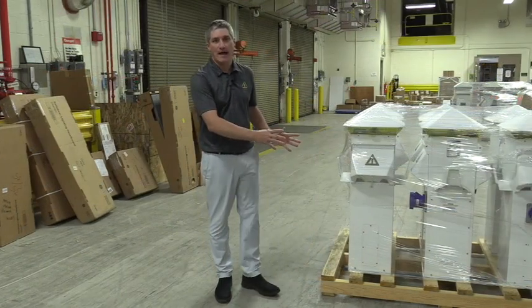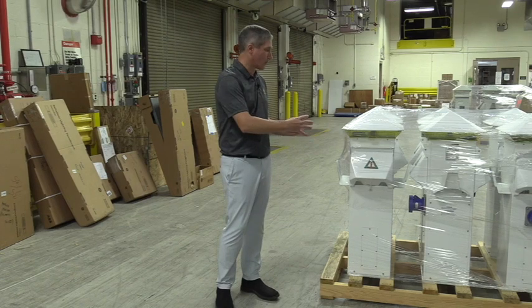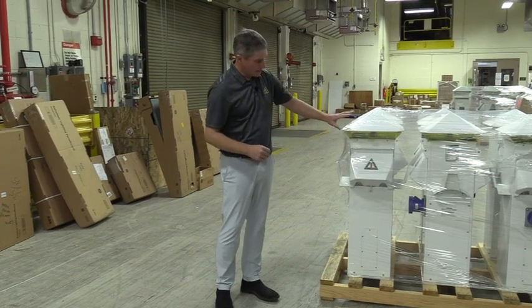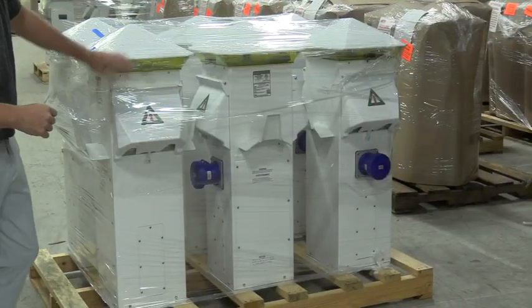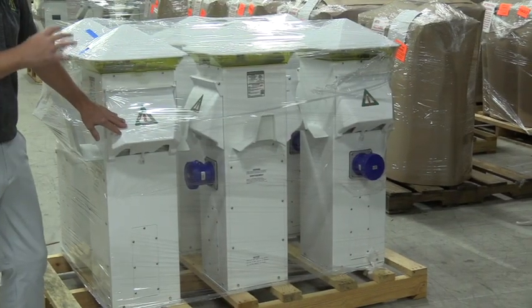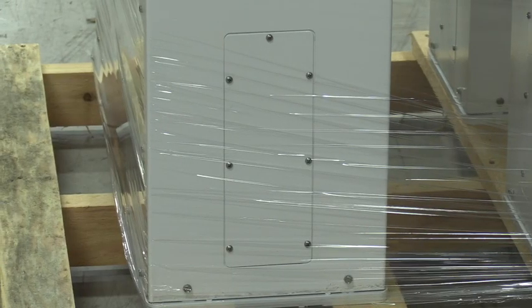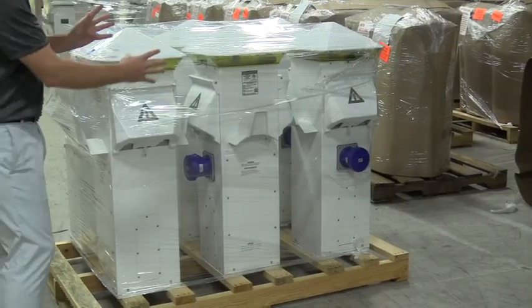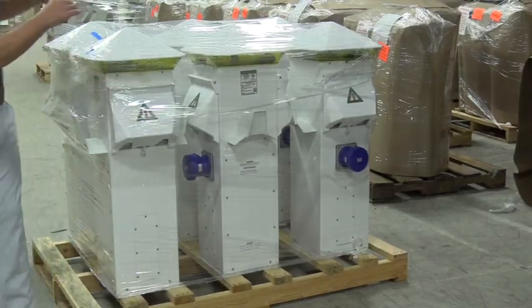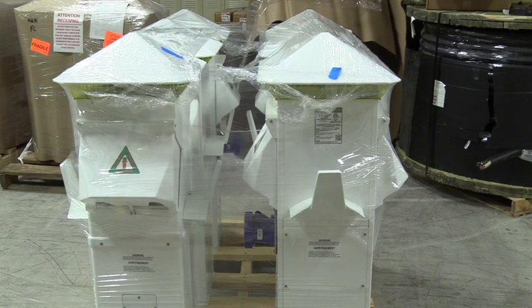Once you've checked out the pallet from the outside with all of the packaging on, while the driver is still there, we're going to want to remove all of the packaging. You're going to want to make sure that all the parts and pieces are in one piece. Are there any cracks? Does there appear to be any damage in any paint? Any items that look like they have come loose during shipment? If any of the bolts appear to have been damaged, you're going to want to note that on the bill of lading. Not only check everything from the outside, but we also want to get inside of the pallet and take a look, because not all damage is going to be visible from the outside.